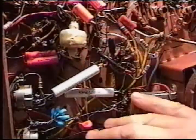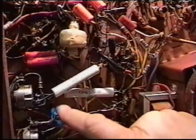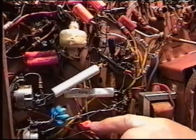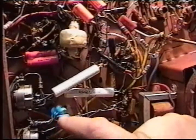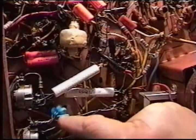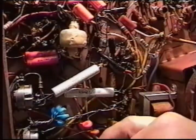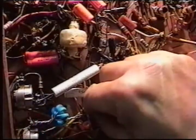If these other parts come in the mail, I can change this unit — a .001 at six thousand volts. But basically I want to change this big glob right here, because one, two, three, four, five of these little disc capacitors to replace just one of these is kind of wasteful. So I want to be able to remove this eventually and do it right.